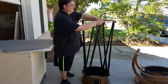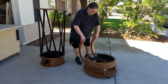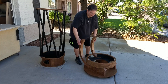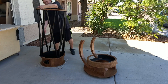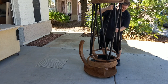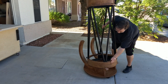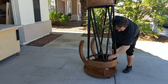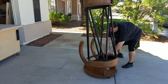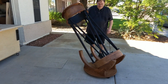They don't have to be tight tight, just until they get snug. For the final assembly, to put the whole upper tube assembly on the bearings and mirror cell, you want to level this so that it's fairly flat. It'll kind of stay that way when the mirror cell is actually in there — there's enough weight there so that it would be solid. The whole upper tube assembly just drops down in place. You line up the holes and, once again, hand tight. I usually get the first one started, keep a hand on the assembly, keep a hand on the second one. There we have it — an eighteen-inch Renegade telescope.